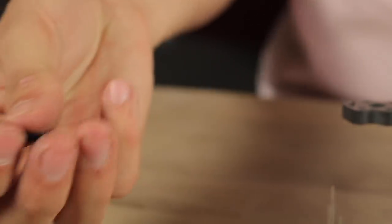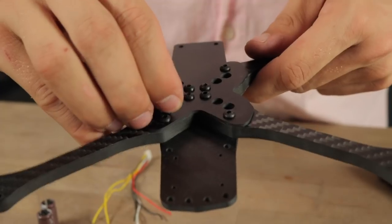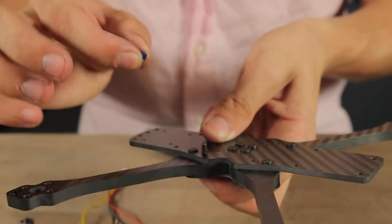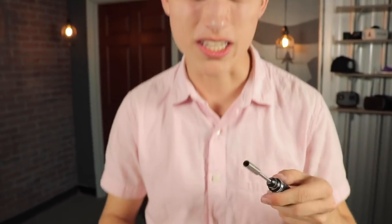Once the arms are installed, we're going to install the stack screws that hold our 4-in-1 ESC. We're using M3 by 12 millimeter screws — four of them. Since we're using a 30x30 ESC we're going to use the outermost holes. The screws are recessed so they sit in nicely. Once one is installed, flip the frame over and use a hard M3 lock nut — not the plastic ones — to keep the stack secure. You can use a 5.5 mm driver to hold the lock nuts or needle nose pliers.